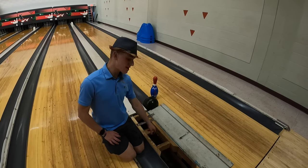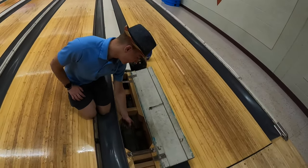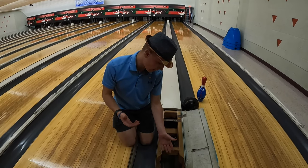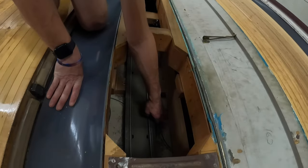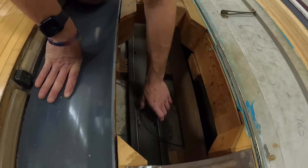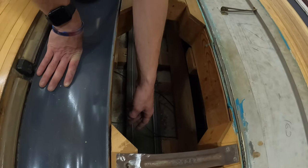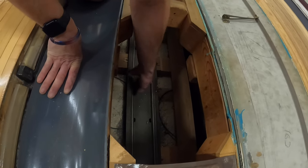In some cases the ball may come off the track for a few different reasons. The track could be loose or broken, there could be obstacles in it, or the rubber on the sides may be worn. Another cause — which has actually happened here — is wiring that runs along the bottom of the lanes. I've seen a piece of wire get across the track and cause the bowling ball to shake, and the balls were actually getting nicked from hitting the side of the upfront ball return. Make sure your tracks are clear and safe for the ball to move smoothly.